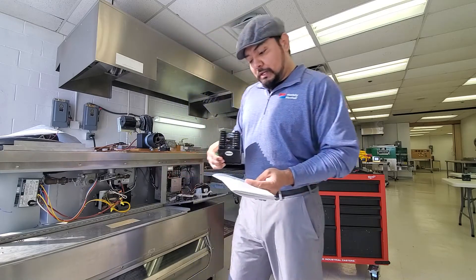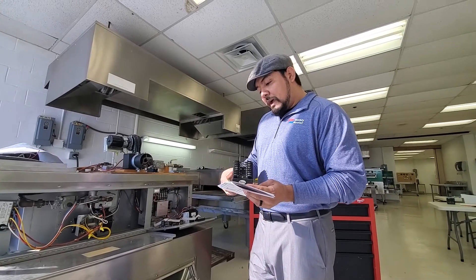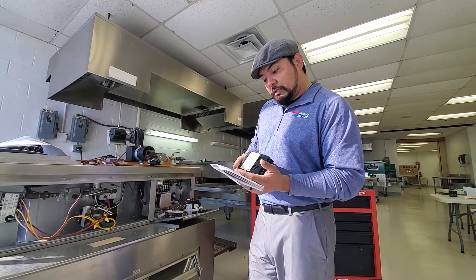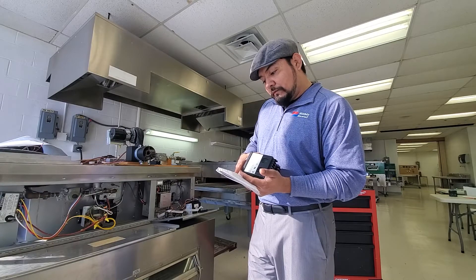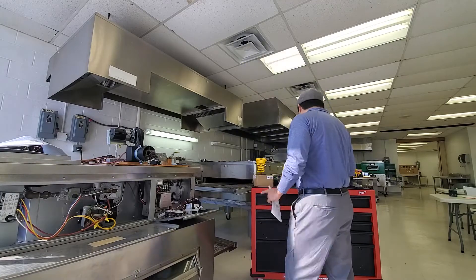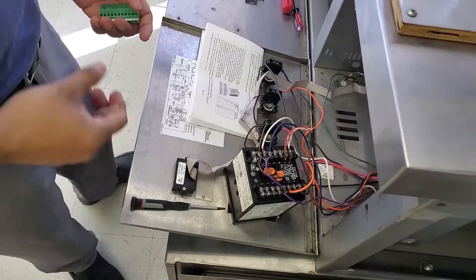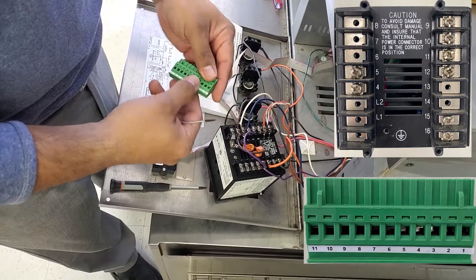The one I'm most concerned about — this is a PS360S — is that I will definitely have a jumper going from number five on this terminal block to number ten, corresponding to L1, 12, and 5 from the back. Simply put, I'm going to start doing some wire-for-wire swapping here. I'm going to go from the Honeywell controller and wire it up with these terminals based off of that chart.